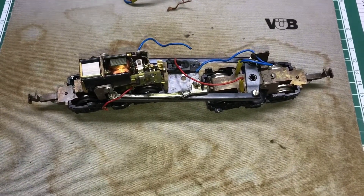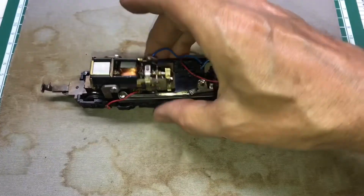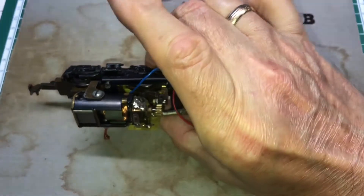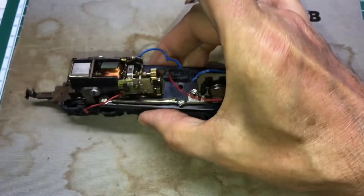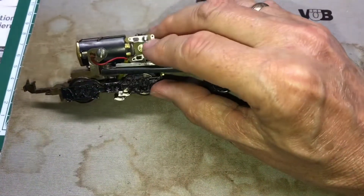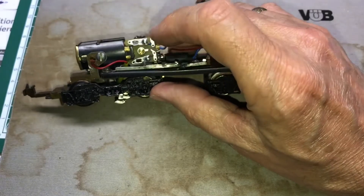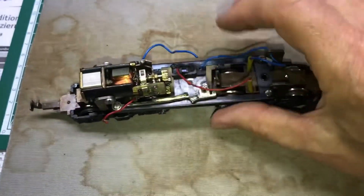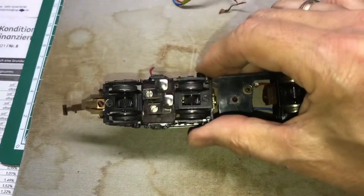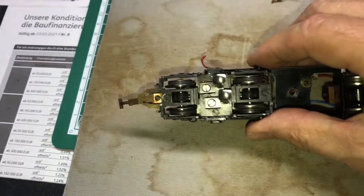We are now a step further. I have now renewed the motor brushes, and I have the whole gears nicely through the transmission of the worms for the drive. I have the motor plate, the motor shield where the pickup was mounted - the old one was broken, so I have renewed that too. Both wheels on the bottom, with the corresponding gears, were on one side totally worn down, and I have changed both of them.